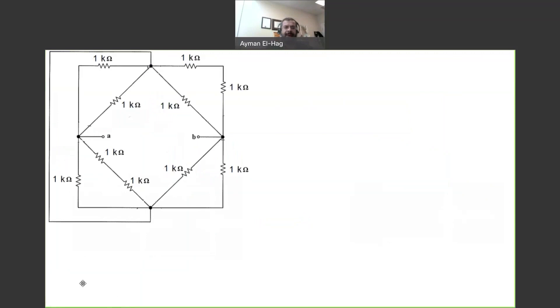We have plenty of resistors that are in series and in parallel. Let's follow the procedure as we outlined it in the previous two examples. The first thing I need to do is identify the nodes, because in a question like this there might be far fewer nodes than you thought. I need to find the resistance between point A and point B. Point A I will call node number one — and here it would also be number one because this is the same node.